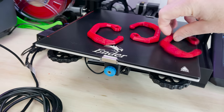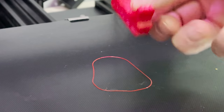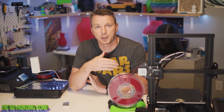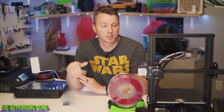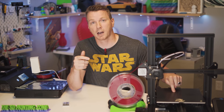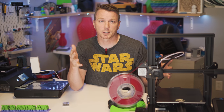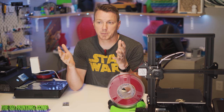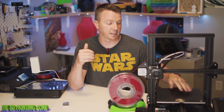In the last few prints I've done on my Ender 3 V2, I've gone down with my phone and filmed the prints sitting on the bed. In pretty much every case, they're just sitting there — I just pick them up and they're already released from the bed, which is fantastic. Now there are a few things you want to be aware of for upkeep. In some of my videos I recommend isopropyl alcohol to clean your print bed, but it's actually recommended that you do not use that on carborundum beds. Just use soapy water to clean these off.